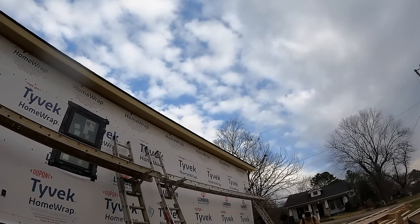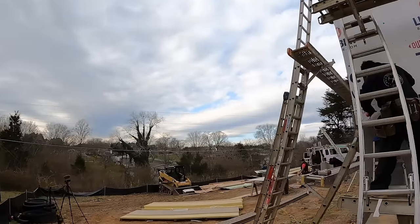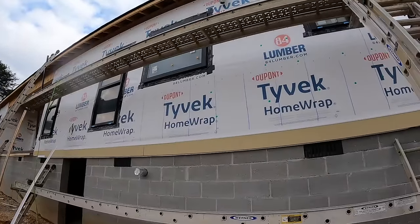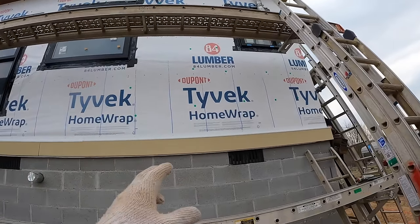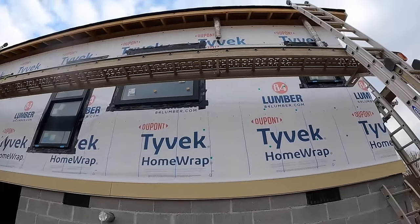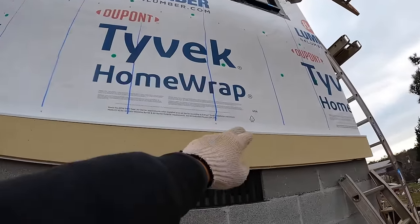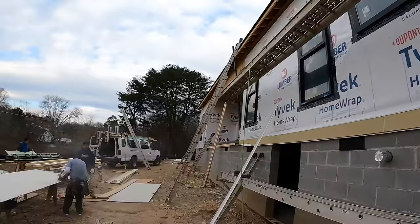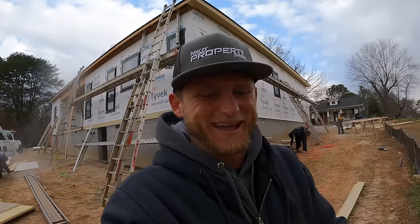This is absolutely beautiful. Seeing this come together, and I'll actually show you what's happening on the other side here with some of these other guys working on the bottom. They're starting to put up the panels. So you'll see the board and batten working here. You see they got their lines every 16. So I chose 16 inches between because these are 4 foot by 10 foot. So they're gonna go up 10 feet and they're 4 feet across. And then the strips are gonna go there. So you got that Z flashing right there, and that's gonna be beautiful. And once all this is painted, oh my gosh, it's gonna be phenomenal. They're working hard, I'm excited. Can't wait to get this thing done, man. It's so beautiful.